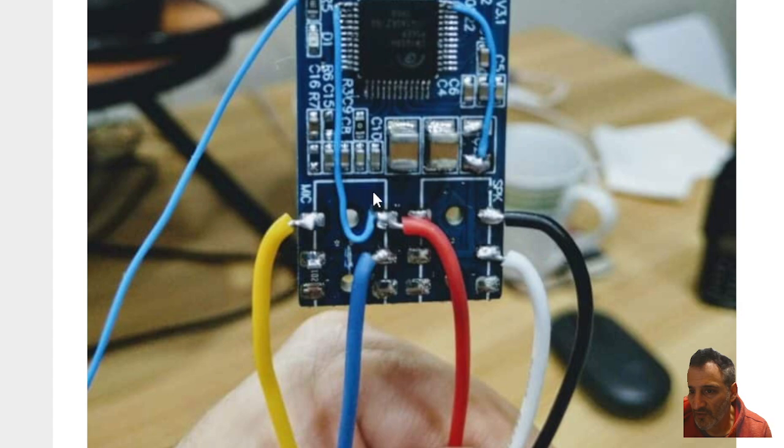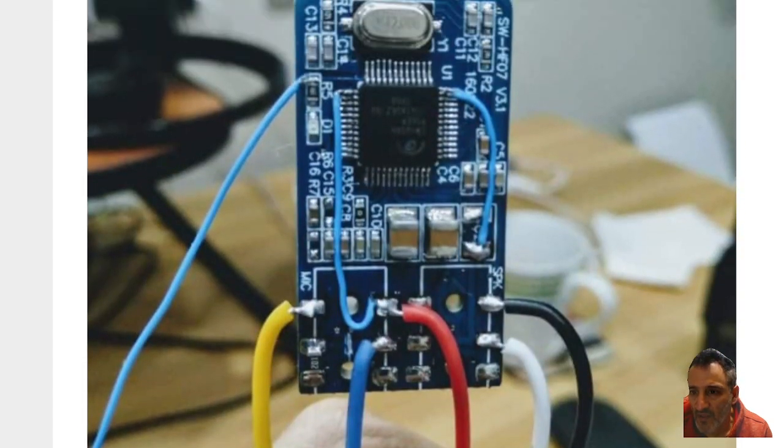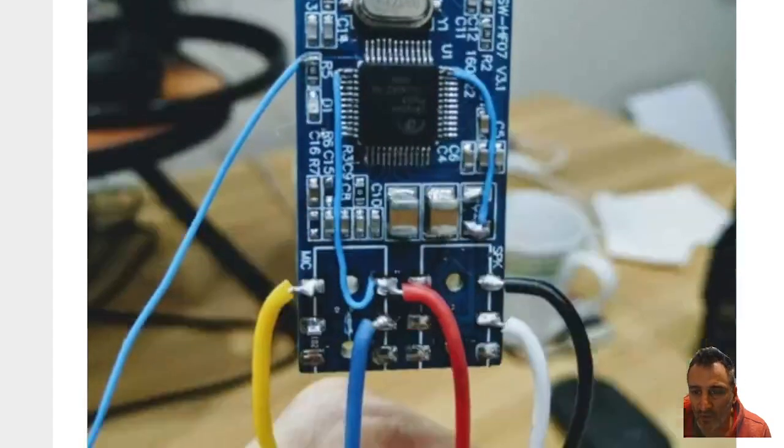Once you've removed it, you have nine, six — twelve pins at the bottom where all the wires are hanging from. Then just follow these instructions very carefully. The hardest wire I would say is just where you tack a tiny little wire — see the blue one — to the very last pin on the top right of the square, and the top left there when it's facing with the USB part that plugs into the Raspberry Pi at the top. That's the hardest bit. Never pull on this when the solder's cold — always remove and install when everything's hot and melted, otherwise you'll break the pins on the fob.